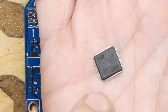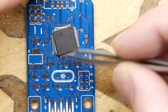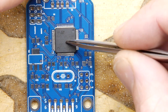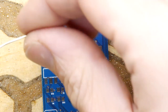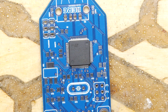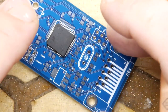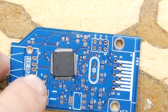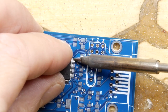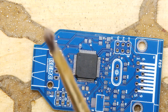We're going to get the board, see where pin one is — you can see there's pin one there, pin one there. I'm going to lift it off and pop it down. I'm going to solder this manually pin by pin because it's damaged now, so I need to take a little bit of care. I'll solder one pin on the edge and do the same on the opposite corner until it's all centered and stabilized nicely.